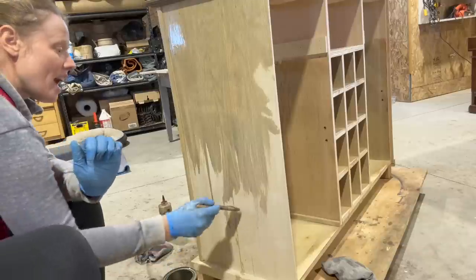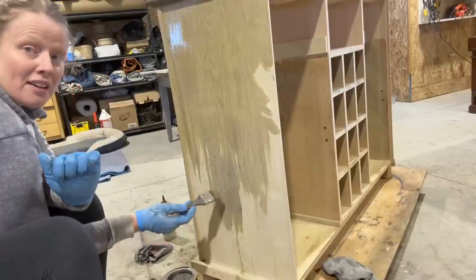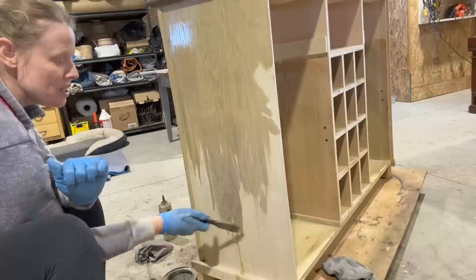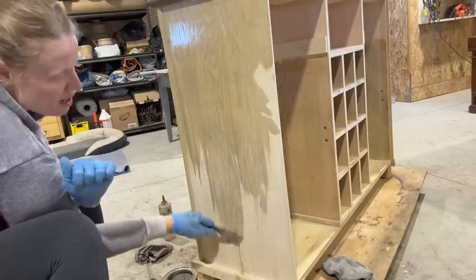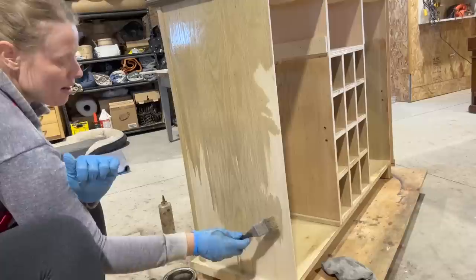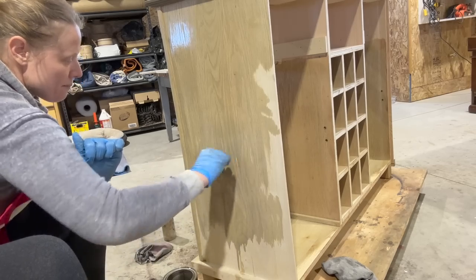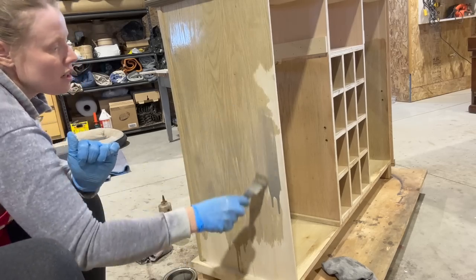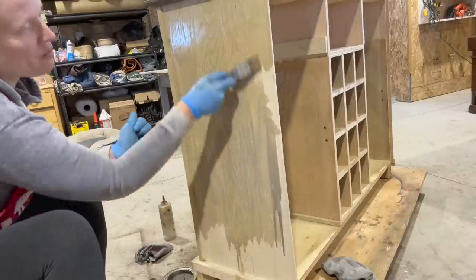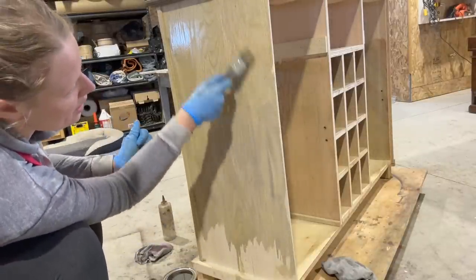but just let me show you something. If I'm just brushing like this, do you see how much material is left right here? It's just running down. I mostly turn my brush sideways to redistribute the stain. So when I come across here like this, I'm stringing out that brush full of stain farther on the piece instead of just brushing across and having way extra material here that I can reuse and redistribute across the whole thing and save some stain.